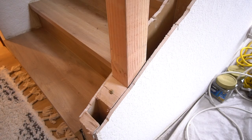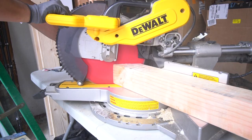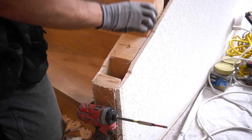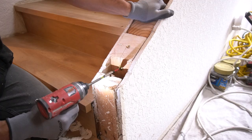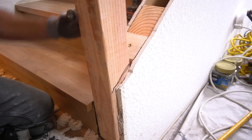For railing, one of the most important parts is making sure it's structurally sound and can hold a considerable amount of weight. Since we removed all the 2x4s and the majority of the framing, we need to beef up the existing base before installing our new railing. This 4x4 blocking is exactly what we need, and I'm using six-inch long lag screws by Power Pro, which provides an extremely strong hold — especially important with a stair railing.